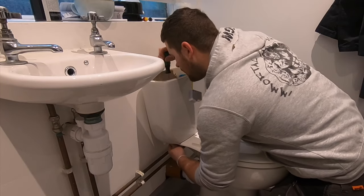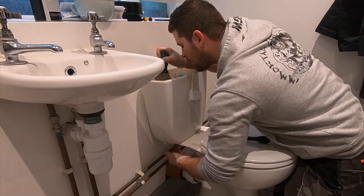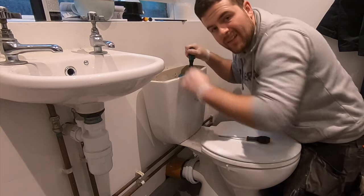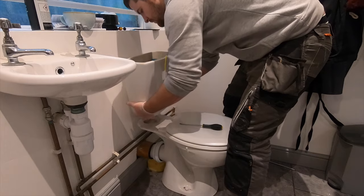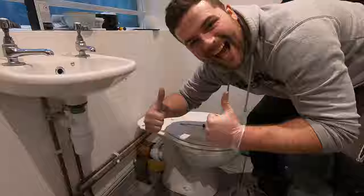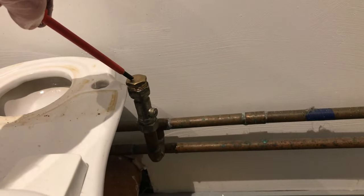Make sure you've got your dust sheet down or a sponge. Then get a flat-headed screwdriver and undo the wing nuts at the bottom - always take care not to lose all the screws. Once you remove the cistern system, make sure you cap the cold mains outlet so no accidents can happen.